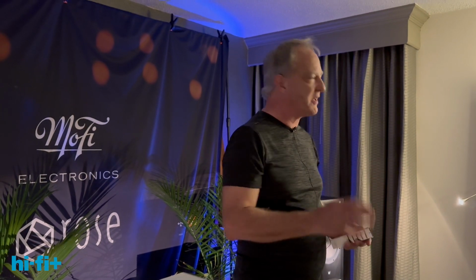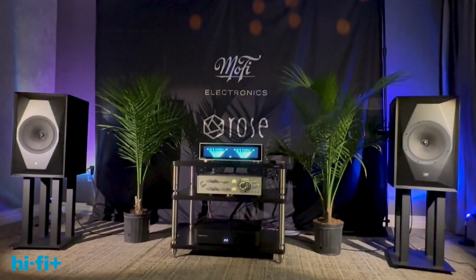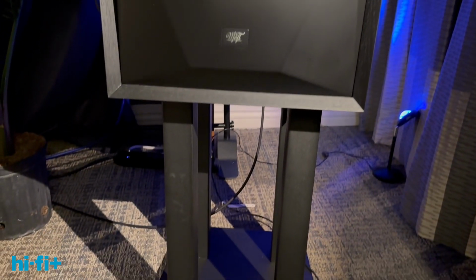You know, it ought to work, and there's precedent of large coaxials in the pro audio field, with Tannoy as a good example. I don't want to use a compression driver, so I want to be crossing over higher than they would be. So now I need a 10-inch cone that works all the way up to, you know, roll off at 3K, no cone resonances up to 3K. That's a tall order. What I do know is a lot of the pro drivers, they use them in systems where the bass driver is a bass mid and operating up to quite high frequency. So it's possible. Now I have to see whether I can make it a reality in the way I want to create the speaker. And that's what the next 6 months was for, to start playing with that idea and coming up with cone profiles that I might need and getting them tooled.